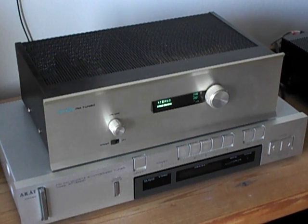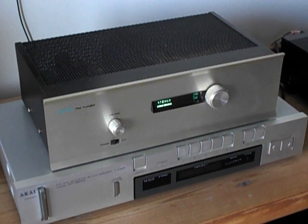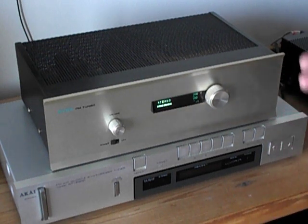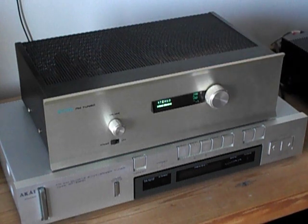So what I do is, under the chassis, I use a terminal strip and individual capacitors mounted in a place where there's a screw hole. So I used 4 brand new caps, put in some new dropping resistors, because you've got to clip the old ones out. And so it's a nice clean installation underneath. It can be removed. You can hook back up the old can. It wasn't humming or anything, but boy, did it clean up the sound.